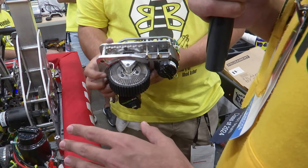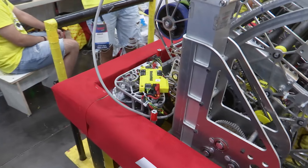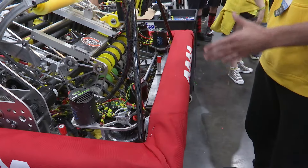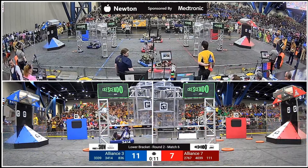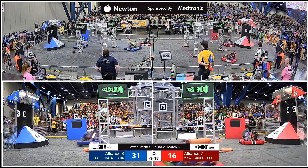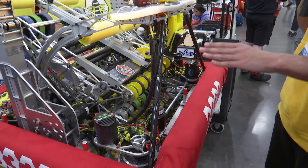Two modules in the back appear to be regular MK4Is with motors at the bottom, but the front modules have motors at the top. This is because their intake is an under-the-bumper intake, designed to avoid collision and operate entirely in autonomous. To widen the intake and create more area for note collection, the motors needed to be inverted upward. When a note is collected, it goes immediately into the robot with nothing happening outside.